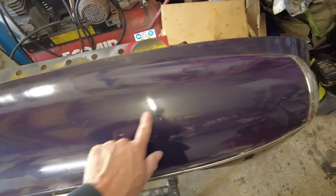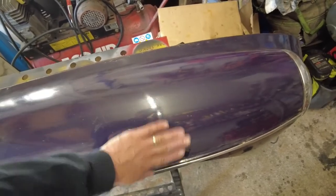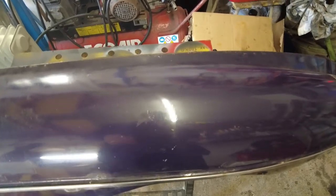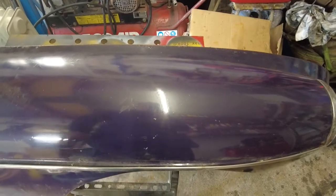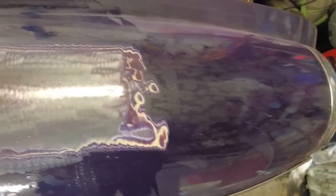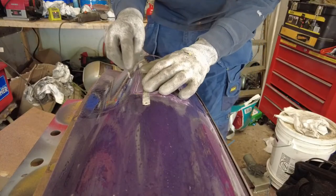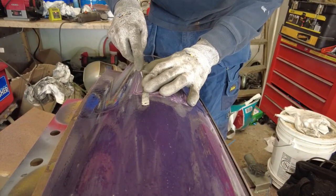I'm going to make a square about four inches across, and yes, I'm using the curved piece because I may as well throw myself a little bit in the deep end. What we're going to do is mark that out — before I mark it out, I'm going to actually grind the paint back, and once the paint is ground back, I'm going to go around it with a scriber and mark out the square that needs to be removed. I don't actually have a scriber — I'm going to use a pick.